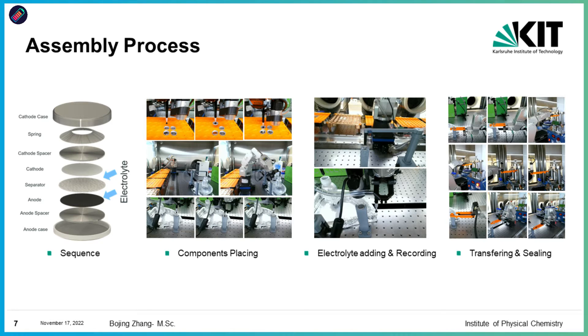In the beginning, designing and coordinating all the devices were our primary challenges — how to design all these procedures, make them standardized, and make them coordinate and work properly. Then the challenge became increasing the reliability of our system, which involves how to pick up and place components, because all these components have different sizes and properties. For example, one challenge is the static charge on the separator: it's very light and basically sticks to every surface it comes near. We addressed this by building a conductive tray and grounding it.